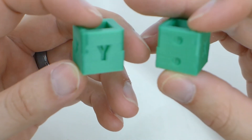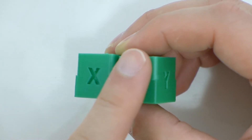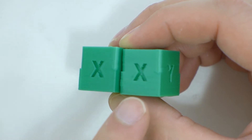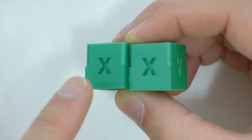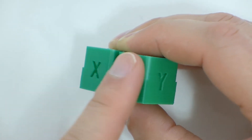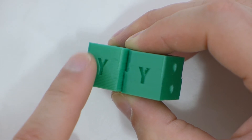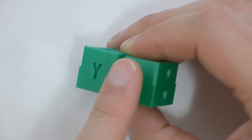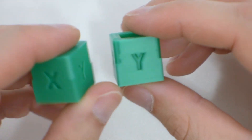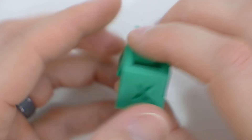I printed a lot of these models on the Monoprice Select Mini. I wanted to show you the difference in layer heights. The model on the left is printed at 0.2 millimeter layer height, and the one on the right is at 0.0875 millimeter layer height — the second finest setting on the Monoprice Select Mini. You can see significant banding on the 0.2 but not as much on the finer setting. On the finer setting it's very smooth; there's still some banding so my rod is obviously bent a little, but it looks nice. This test is mainly used for ghosting to see what your printer is doing on different axes.